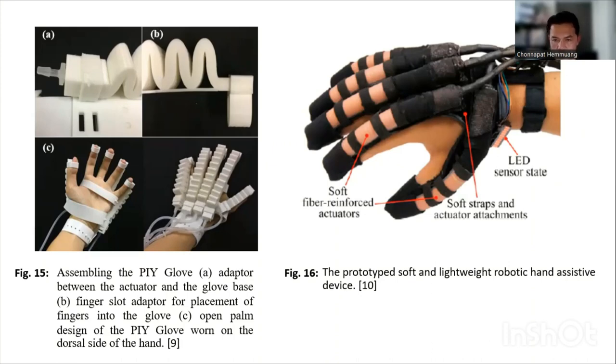To address this issue, this study offers a unique design for a soft-robotic glove used in a two-sensor closed-loop system with a flexible sensor and a pressure sensor mounted on soft actuators. The soft-robotic glove features more degrees of freedom and a greater range of motion designed to endure high air pressure. Two closed-loop control systems are demonstrated to manage air pressure and finger angles. A model-based design approach was offered as a cost-efficient, desirable, and effective technique. A novel test bench for evaluating the soft-robotic actuators with flexible and pressure sensors combined was also introduced.